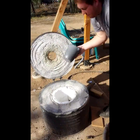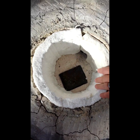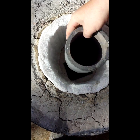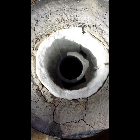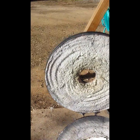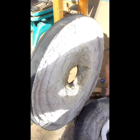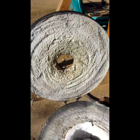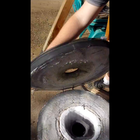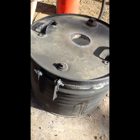Here I've got the crucible on the bottom. On the sides and the bottom I put some ceramic fiber insulation. This is just a fire brick to give the crucible something to sit on. For the lid, I cut off like two inches of the top of the barrel, and inside I welded a grid of rebar across so I could pour the cement and the rebar would hold it in place. Then I welded the hinges onto the back and drilled a four-inch hole in the top for the exhaust.